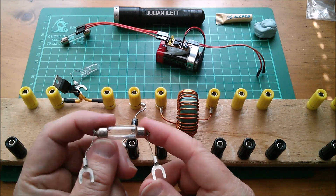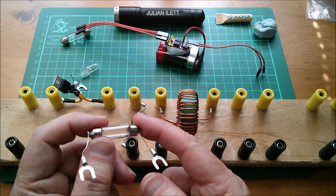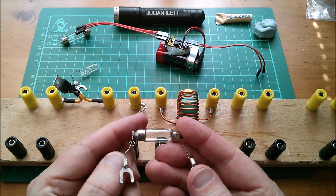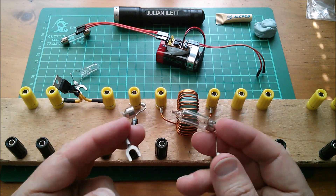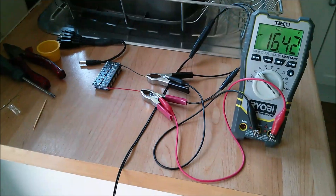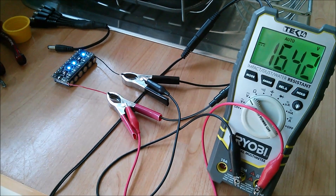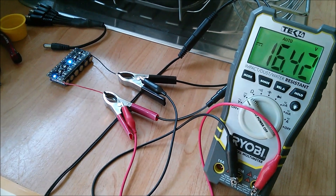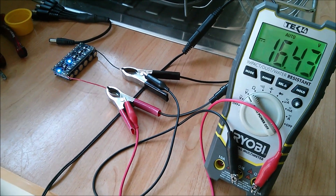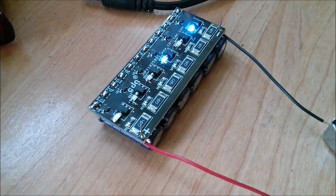I'll probably make up some more of these various loads. This is a 5-watt 12-volt lamp — you can drive these up to about 15 volts; they're quite tolerant of higher voltages because they're used in vehicles and when the alternator is running it's 14-point-something. But these lamps from the pound shop just fall apart, so I need to get some better quality ones — maybe from Halfords or something. We've got very nice weather, about 10 days of it. Muppet 2 is the project of choice. I'm interested in solar stuff because we're getting fairly uninterrupted sun. And blinking lights — everyone likes blinking lights. Cheerio.